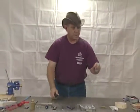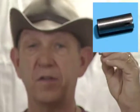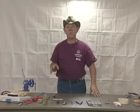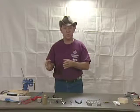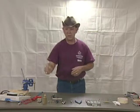The other method uses a pommel nut with a slot for a large flat-tip screwdriver. This has the same issue as the inside hex — if the tang is too long, as you screw it down it will back out. Also, the amount of force you apply can separate and eventually break the nut. A key tip: if you have multiple weapons — foils, épées, or sabers — make sure you have the same style of equipment on all of them. I personally like the outside hex because of the tang length advantages.